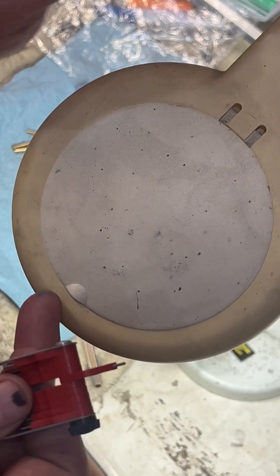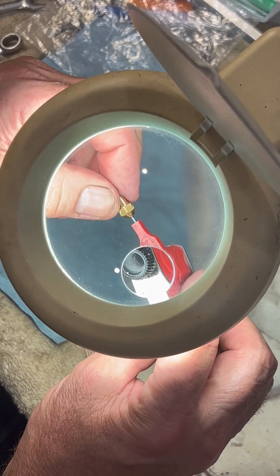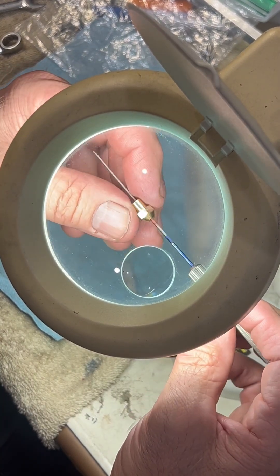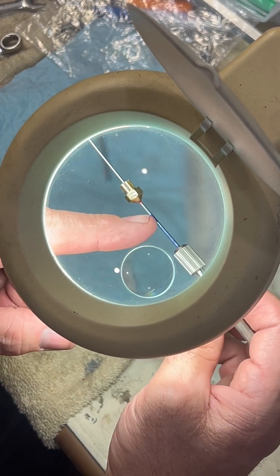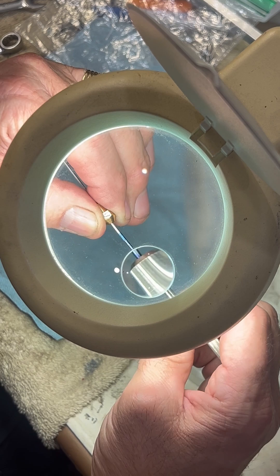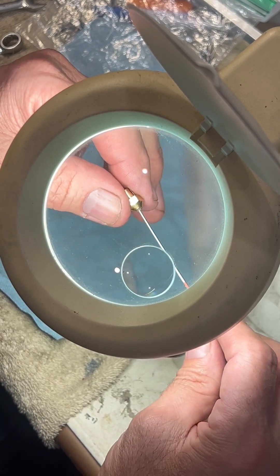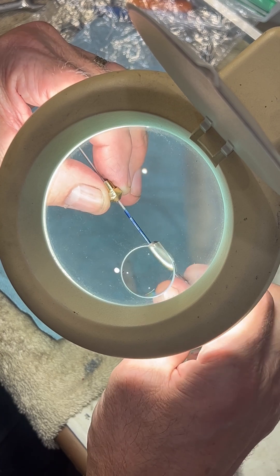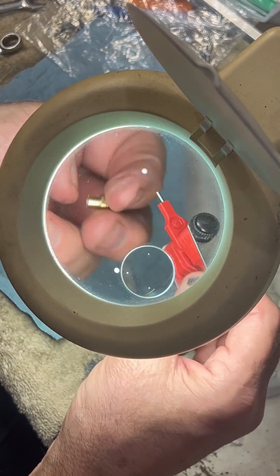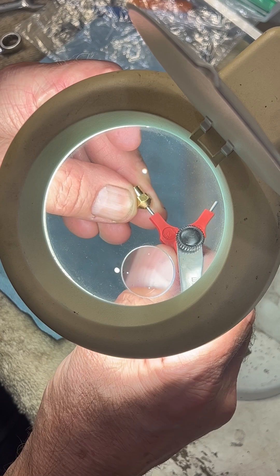I come in here with my 120s and I try to confirm that it's not going to go in there. From this file, red starts right around 115 and the start of the blue is about 125, so I'm going to go about halfway, or a little bit past the red — always conservative. Almost goes in there, we'll try just a little bit more. You can see it fits in there, and I'm going to confirm I didn't make it too big. Yeah, it's not going in — 120s.